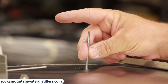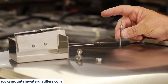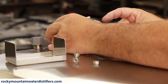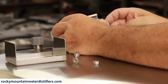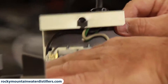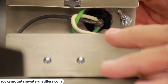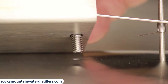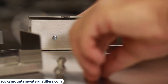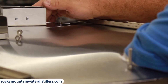After you get your spring on your float, it's time to mount your switch box. The first thing you do is slide the switch rod through the spring. Here's your switch on the inside — you put a bolt down through that hole, and that hole goes in the tank right there. You slide it down into the hole and take a nut, reaching into the tank to tighten that box into place.